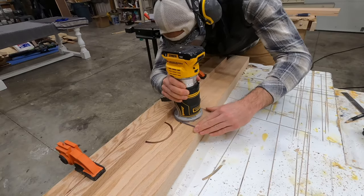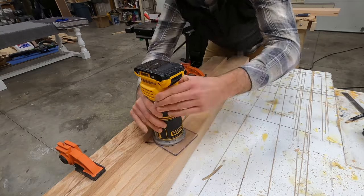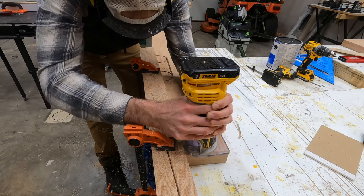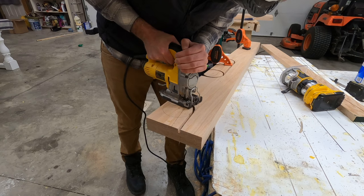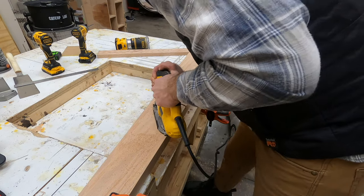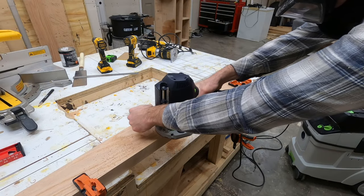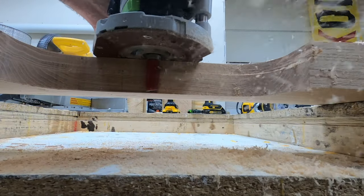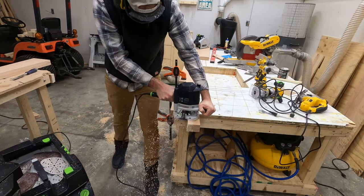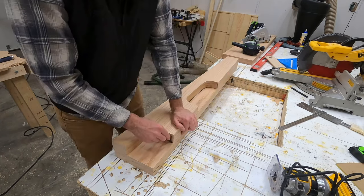Typically when making legs with lots of curves you'd use a template, which either requires a CNC to cut out or you could buy templates online. I'm not sure if my refusal to use templates makes me creative or stubborn, but I didn't want to use them. After drawing the lines on the pieces, I grab my palm router and cut a few circles on those curves using a spiral upcut bit — this gets a clean edge that you can't really achieve with a jigsaw or bandsaw. After routing those circle grooves down about a quarter inch, I grab a straight edge and connect those lines again with the router, giving me a clean line on the top surface. Then I cut the excess off with a bandsaw and go back with a flush-cut trim bit to smooth out those curves.